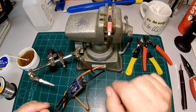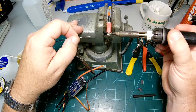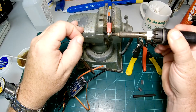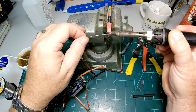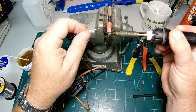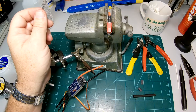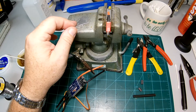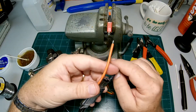I've put a little bit of rosin on the connector and I'm going to heat it up so it kind of melts away — you can see it burning off. I heat it for a couple of seconds, then put the solder down underneath the tip, and as you can see it's flowing pretty well. I like to get about a pea-size glob of solder on my connector. If we were doing a battery, I'd just go ahead and finish connecting one side completely.